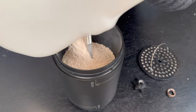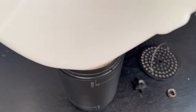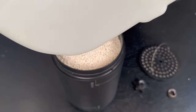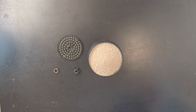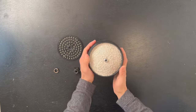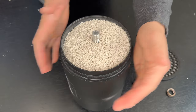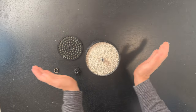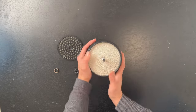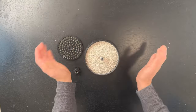This is one of the most important things you're going to do with your rebreather during the build process. You're going to want to fill this up until it makes a cone that rises above the premix tube rod. I like to take my finger and just clean it off slightly, and then I start to tap. As you're tapping, you can actually see it settle out a lot. I'll do this for quite a few minutes just to make sure it is just right. As soon as I see the granules stop moving, I know they're packed down, and then I'm confident there won't be any channeling when I put that lid on and tighten it down.